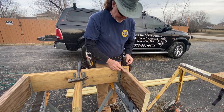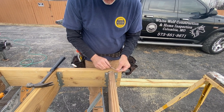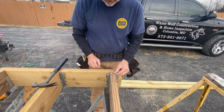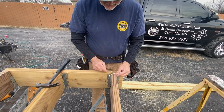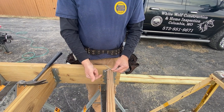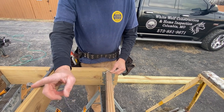This is what's going on — when that inch-and-a-half nail is through there, if you look on top you can see it doesn't even get all the way through the floor joist and back into the ledger. With the right length nail, it almost fully penetrates the ledger board as well. That's quite a bit of difference, and it makes a big difference in resistance to uplift capacity.